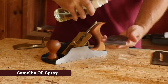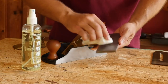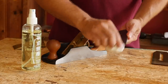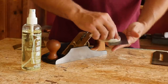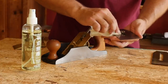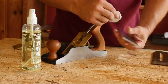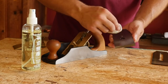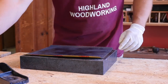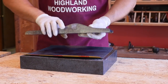Lastly, we have camellia oil. This oil is a blend of the natural camellia flower oil and some liquid paraffin. It's non-toxic, and its light body makes it easy to use on all your edge tools. After sharpening your chisels and plane irons, it's the go-to treatment to wipe onto those surfaces before use or before storing. The presence of camellia oil doesn't get in the way of finishing products or glue-ups. You can also use camellia oil to lubricate wet-dry paper for when rust happens and you need to remove it.